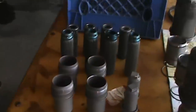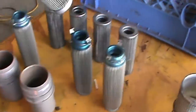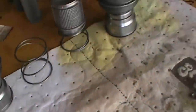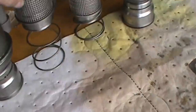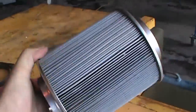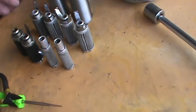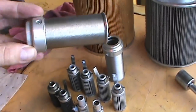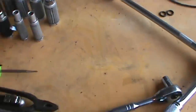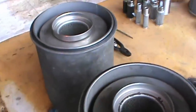Here's a selection of some of the filters we've pulled out of the F-4. You can see the canisters with very fine mesh metal strainers — some of these are cleanable, some are not and have to be replaced. This is a fuel strainer. This is one of the main fuel filters; for as thirsty as these J79s can be, you can see why these things are fairly large — look at that compared to my hand. Here are some of the oil filters and auxiliary fuel filters, including one non-cleanable mesh strainer. And these are the fuel filter canisters — they go into that empty hole I showed on the walk around.